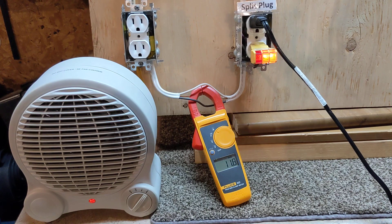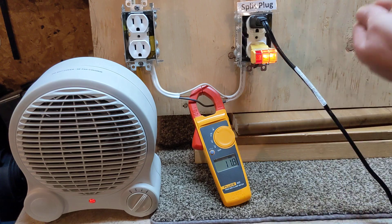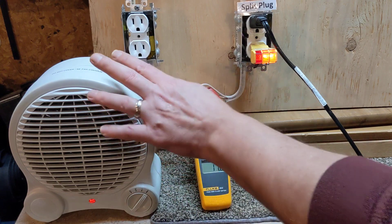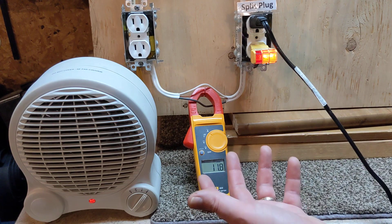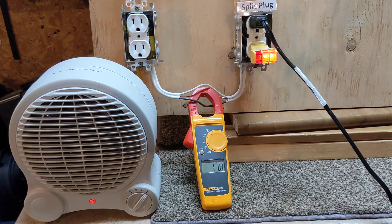If we turn it off, it goes back down to zero — 12.9. Hopefully that helps you understand current, what you can test for and where you can't. By opening it up and trying to do it yourself, if you're not qualified, there's a very good chance of getting hurt and I don't want to see that. With the clamp style, that's how you check it, and that tells you what current is and the difference. You have the formula from Ohm's law to apply it — you can check and say, okay, if this is 1500 watts, how many amps is that? Devices used to always have amps on them, but now everything comes with a power rating in watts, so if you want to know what current it's going to draw, you have to do the calculation. Hopefully that helped — we'll see you on the next one. Throw a subscribe if it was helpful at all.